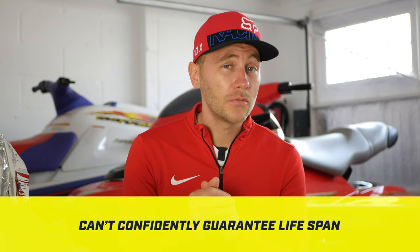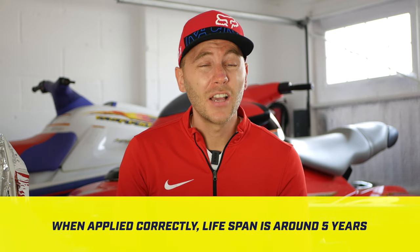Thus, additional time, energy, money, all the things that go with it for manufacturers. And then the fear on top of that for most manufacturers is they can't confidently provide warranty, which is what they want to do with all of their trailers, for a cosmetic-based finish. Powder coating by nature is a hard outer shell coating, so once cracked or compromised, it's essentially going to peel away. But, and it's an important but, and a bit they don't tell you, if powder coated correctly, powder coat is super strong and durable, and the chances of actually peeling are very minimal.